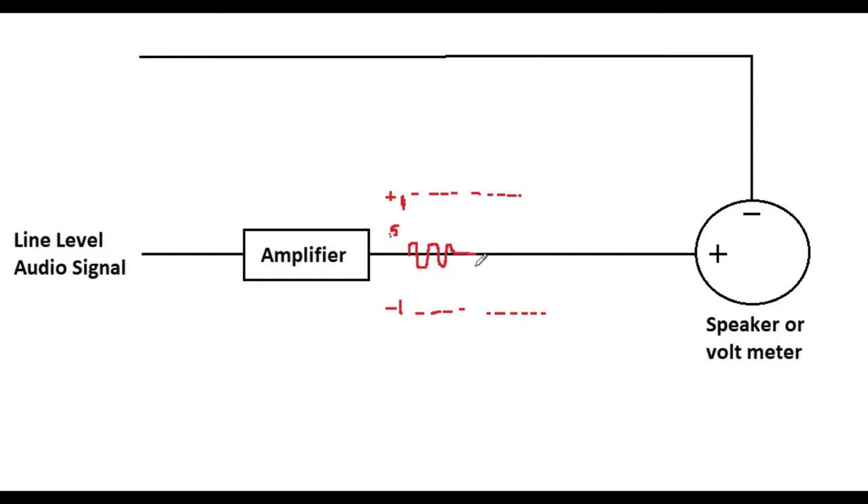As the music starts or we start speaking louder, the amplitude increases. The voltage rises to perhaps a volt and drops to perhaps minus one volt compared to this reference. The same thing happens before the amplifier but much smaller - we're talking about 0.05 volts, that's 50 millivolts. So it's very small and very hard to measure. Our Arduino is happy to measure positive one volt.